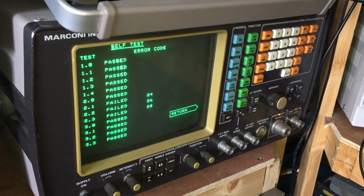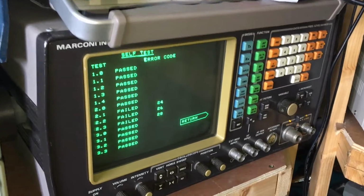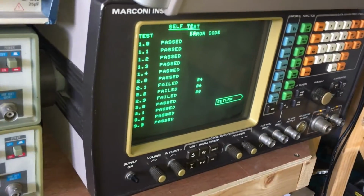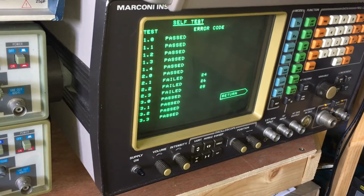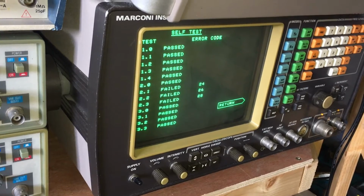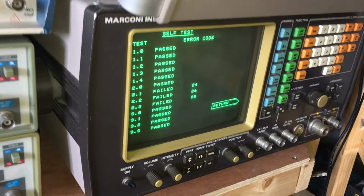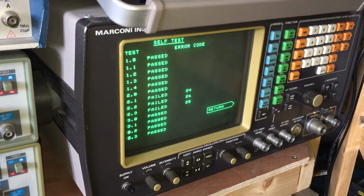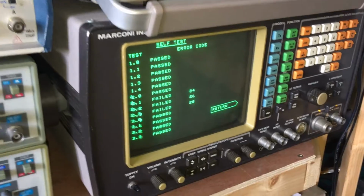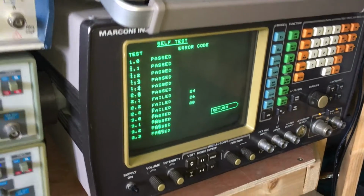Yeah, if I fire a radio into it and just give it a couple of key presses, do the retest, that will pass first time. So it's obviously getting heat into the power meter that's bringing it back into tolerance. So I think what I need to do is, once I get the time, take the damn thing apart, 'cause it means dragging it out of the bench, take it apart, it's a bit of a faff, there's a lot of shielding inside it. It's a hefty great unit, it weighs quite a bit considering it's supposed to be portable.